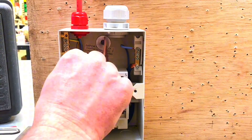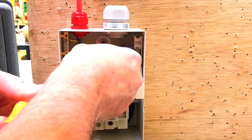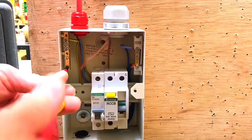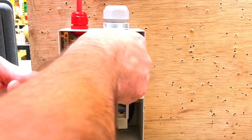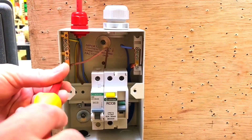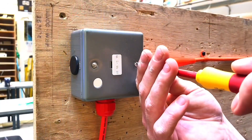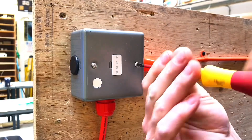This time, however, I'm going to not use the link and I'm going to simply connect the line conductor into the earth bar itself. It won't matter which hole we choose in order to connect it to, meaning that we've got a solid link between the line conductor and CPC before starting the combined continuity of CPC test and polarity.